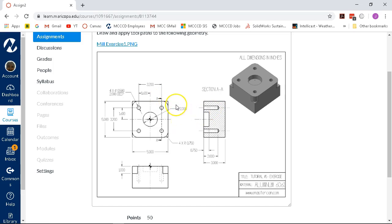So I think I have some either 4-inch or at least the 3-inch material that I could go get a rough number, but there might be enough. And the 3-inch depth, I don't know that I'm going to be able to go all the way around and down. The other thing is, if I did half of this, 1.5 inch depth with the 1 inch to the base, and then turn it over, then I'm almost guaranteed to have a slight mismatch.